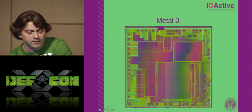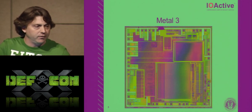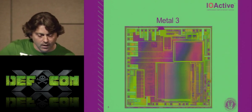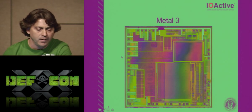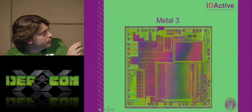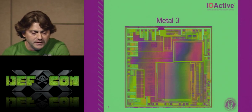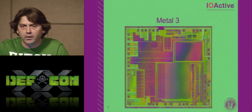That black box is where metal 4 had to be used to finish their modeling of the additional logic that they added into this. The CPU in this chip is all contained to the left of the ROM near this metal 4 area that I continue to refer to. Everything else pretty much has to do with cryptography: hardware crypto units, SHA-1, RSA, triple DES, and so forth.